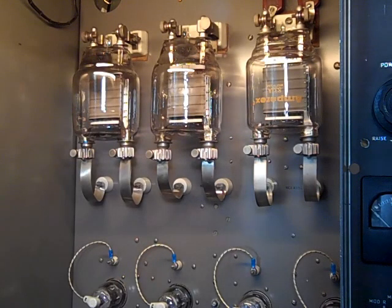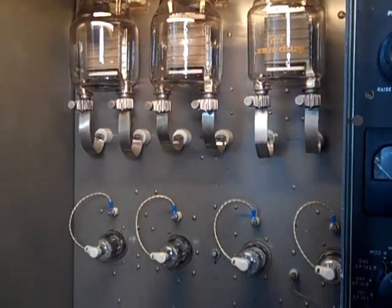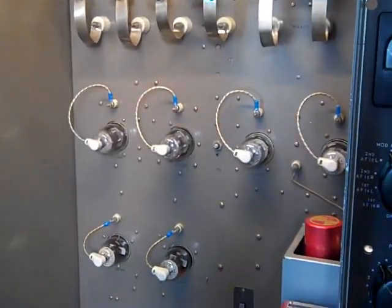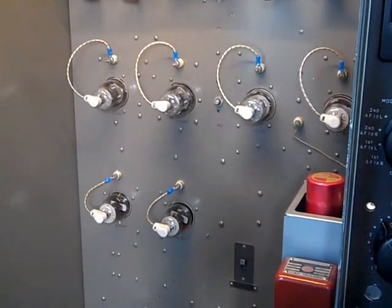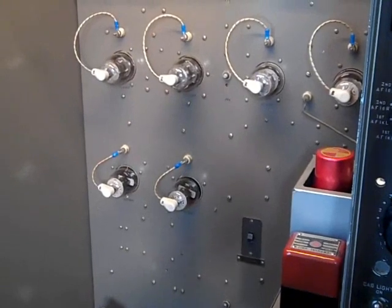The reason for this is I didn't need a thousand watts in amateur service. The transmitter originally used four 833 tubes. The only other tubes used with the transmitter are 807 tubes — there are 807s as audio drivers and buffers, IPAs, and an 807 used in the oscillator assembly located on the right side of the cabinet.